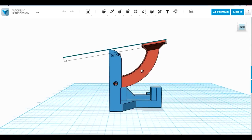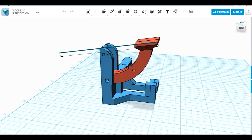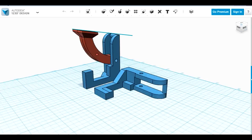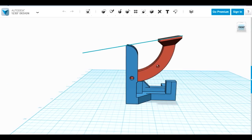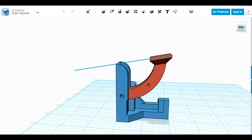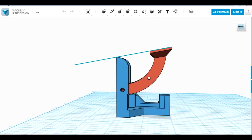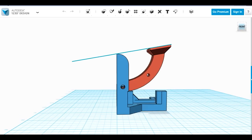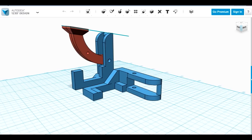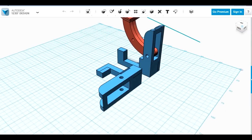Here is my hinge for the head part — for those flaps on top — and it may well be the hinge for the door that opens. The aim is a servo sits in the gap in the middle at the bottom, pushing up against the leverage point on the red hinge part, and that should push up and open the flap with quite a lot of clearance. The blue sketch line shows the angle of that head flap, and the flap sits outside the frame, flush with the rest of the skins. This is going to be printed lying down with support material in that gap, giving the strongest plastic part.